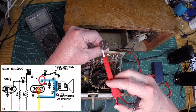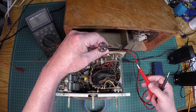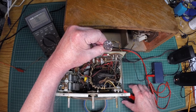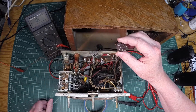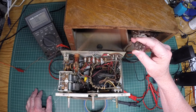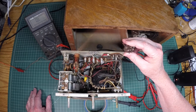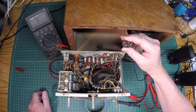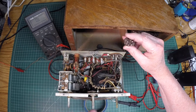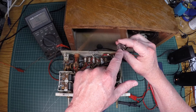It may merely be a bad solder joint or a bad wire, so we're going to have to dig this speaker out and do some more troubleshooting to find out why it's open. Let's do a little additional troubleshooting — I've got my Zenith 5S29 speaker. I'm not sure about the particular audio output transformer, but for giggles, let's use it and see if we can bring the B-plus voltage back on the radio and get any audio out of it at all. I'll grab the Zenith 5S29 and jump some wires from here back over to the primary side of the output transformer.